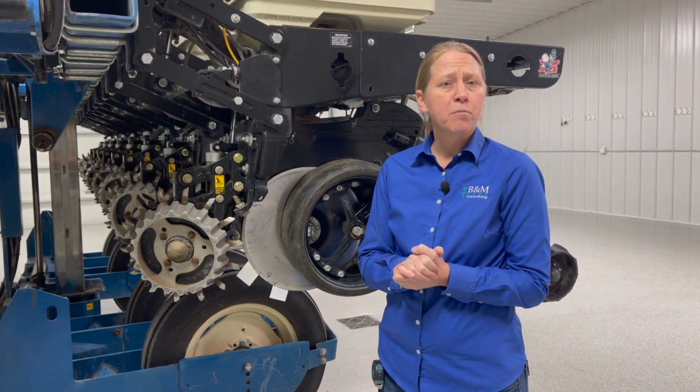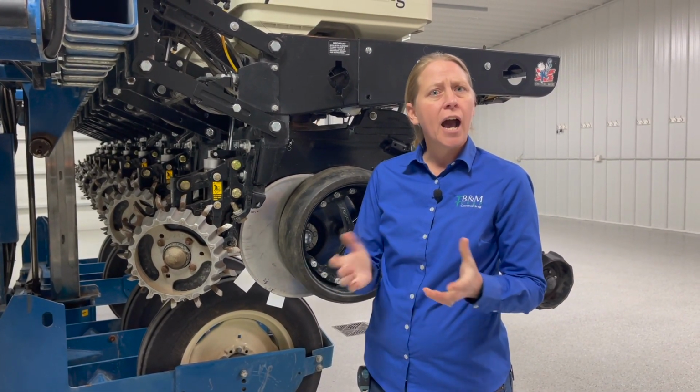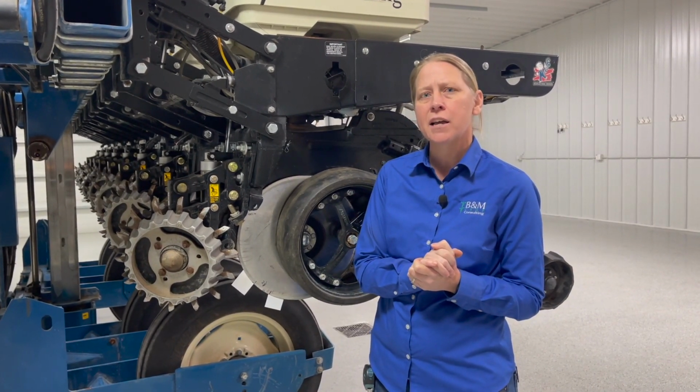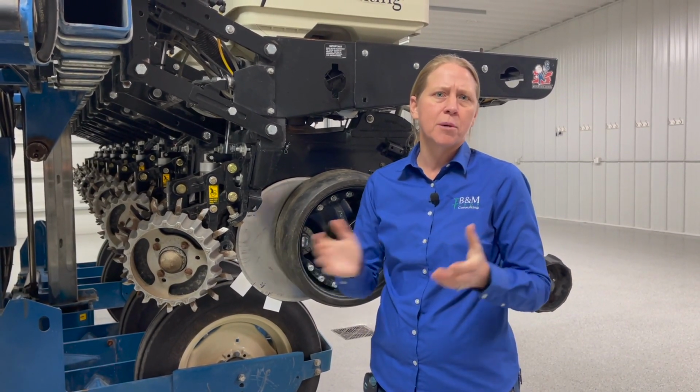We have seen some improvement on some of the aftermarket blades. For example, GBGI, I've seen pretty good luck on those, where I can get that within that 1/4 inch or less variation on my point of contact. So there are some options of other blades out there to try to get rid of some of that variability that we've been seeing.